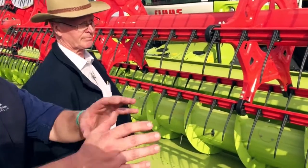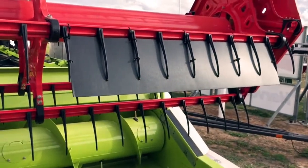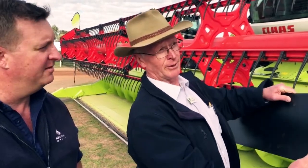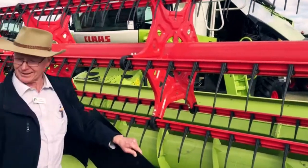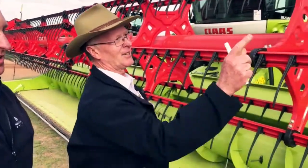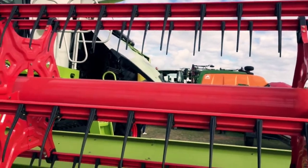We were talking earlier about just where on the bat it's positioned. Rather than doing it in a spiral arrangement, you skip one and go to the next section. We found that our driver, when he had these on and we first experimented, with heavy matting being a concern, your eye tends to follow it. So if the next piece was in sequence, your eye tends to follow it and you could end up with a headache watching these things spiral along — harvesting is hypnotising enough as it is. So you skip every second one to break it up into a random pattern.